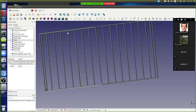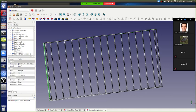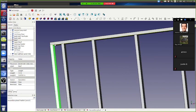We pre-cut all these ones to the right length, which are going to be exactly 16, but these are going to be less. So the workflow could be, if we have enough people, this goes up at the same time. How do you locate the corner? Well, you just have to remember this pattern. Make sure that you don't do the overlap the other way. You can locate it because it's at the edge. You already have the walls and top plate below that's locating the corner.